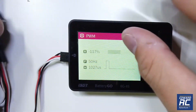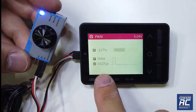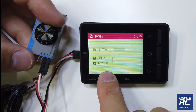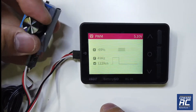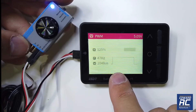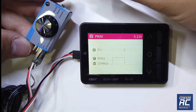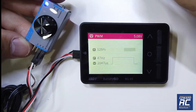Let's go to the menu receiver tester and select PWM first, since this is a PWM signal generator. At its minimum position the old tester is showing about 1000 microseconds. The value range is between 1000 to 2000 microseconds. Rotating to maximum gives about 2000, and at neutral it should be around 1500.